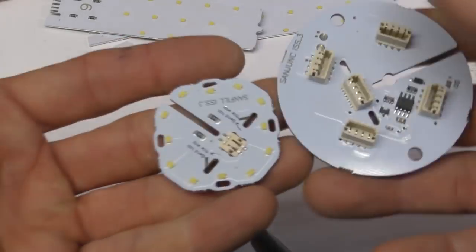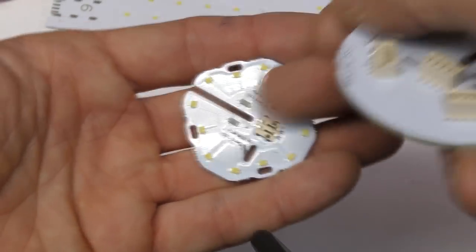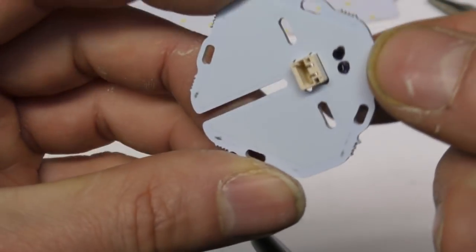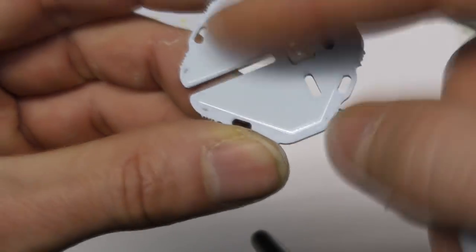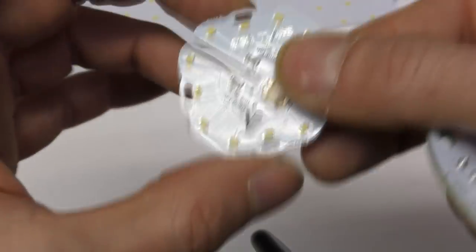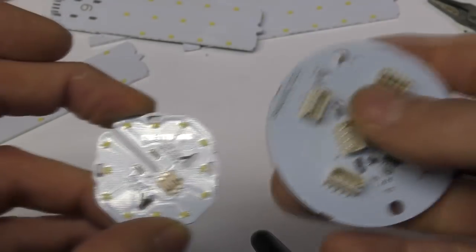So it's much easier just to do these on a separate panel, because the power on this is a lot lower. This didn't need to be aluminium, though it could have been made in aluminium. You can see there's just a single plane on there. That's really for thermal reasons. There's actually no electrical function at all. This is a purely single-sided board, so this could have been done on aluminium, but it actually made more sense to do it on fiberglass.